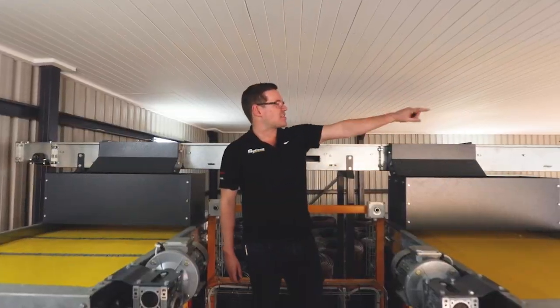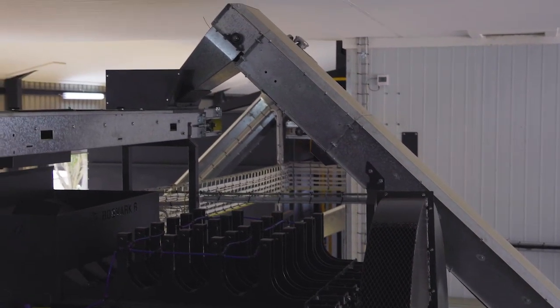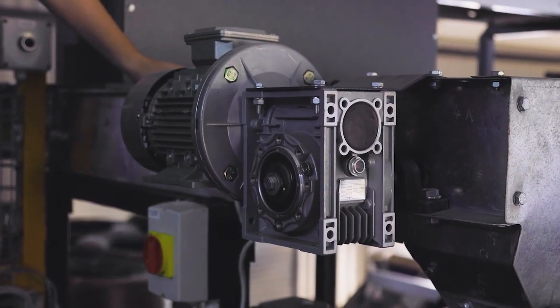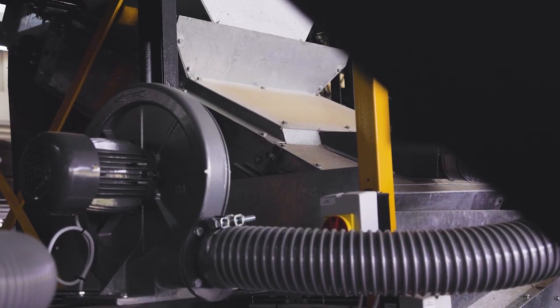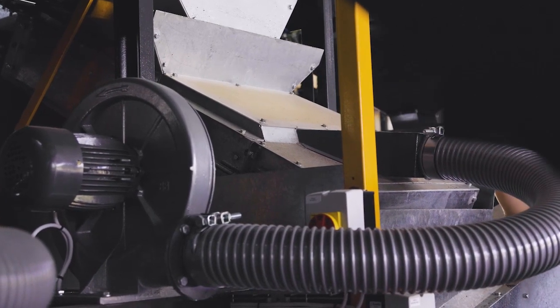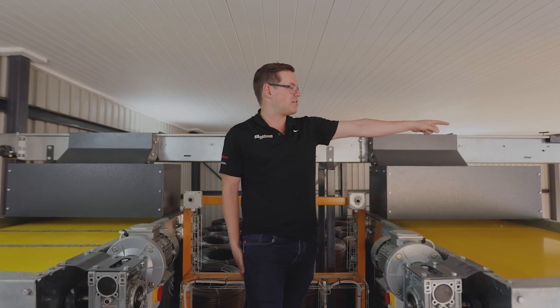So nuts come up the incline across the scraper belt into 2 rubber dehuskers. This is our latest version of our rubber dehusker. It's easily adjustable. You've got 2 knobs that you turn very, very easily. Throughput on this is about 1 ton of nut and shell per hour, if you can separate the husk out properly, which we've done with a blower down at the bottom. Either these 2 rubber dehuskers or the 1 4-lane dehusker over there.